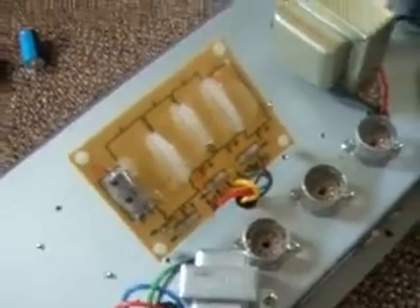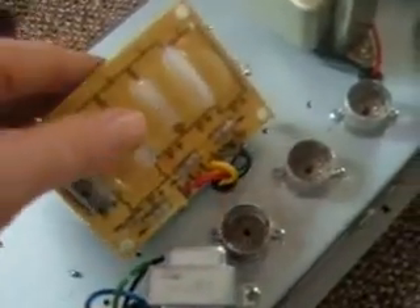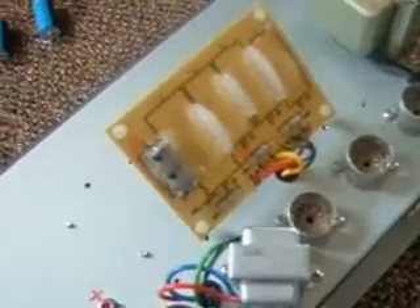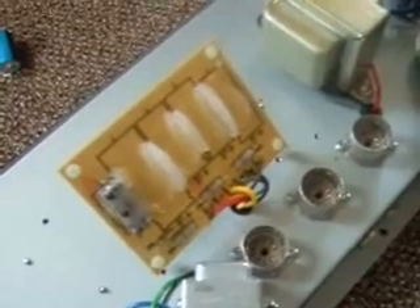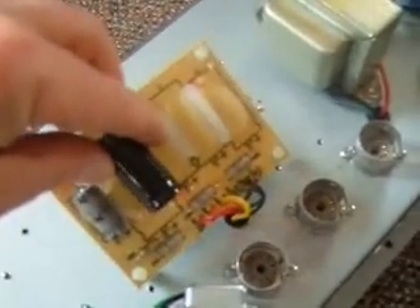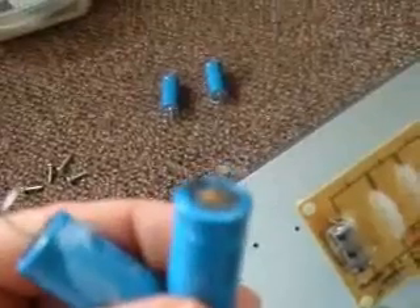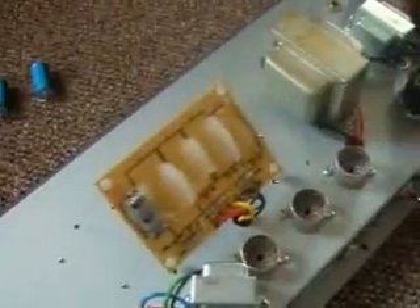Here's an interesting thing — it actually feels like silicone caulk. I'm going to go ahead and leave that in there and embed my new caps right into it, adding a little more after the fact if needed. I'm not going to peel this off. These two were good; these were not. See all that orange pus coming out of there? These two were on their way out — depleted, not working efficiently. If you let them go too long, they could take out other components in the amp.